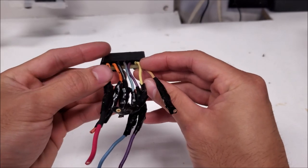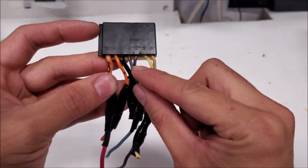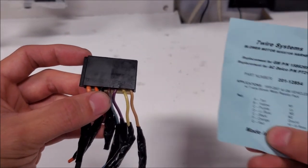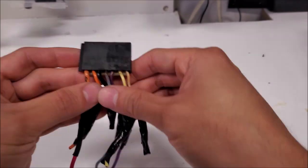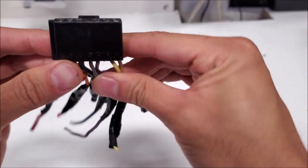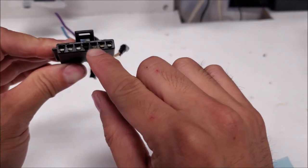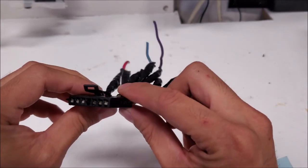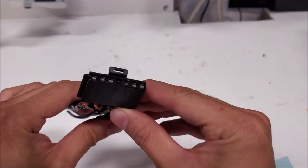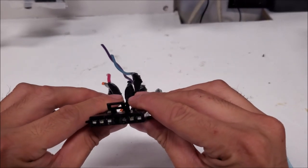Here in better light, we can see our unit. You can see the discoloration on the blue wire — that would be D, the light blue M2 connection. Everything else looks okay, but there's discoloration in the center and also happening over here as well. This connector has a very notorious problem that happens as these things get old. There's a lot of heat going on — you can't expect parts to last forever, so just be prepared to diagnose and figure out the fix.